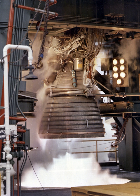The turbine exhaust ducting and turbine exhaust hoods were of welded sheet metal construction with flanges utilizing dual seals at component connections. The exhaust ducting conducted turbine exhaust gases to the thrust chamber exhaust manifold, which encircled the combustion chamber approximately halfway between the throat and nozzle exit. Exhaust gases passed through the heat exchanger and exhausted into the main combustion chamber through 180 triangular openings between the tubes of the combustion chamber.